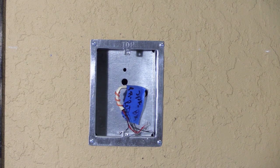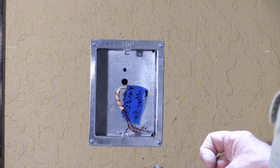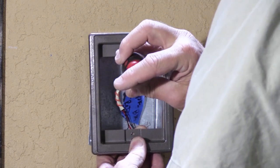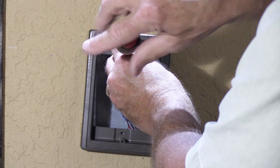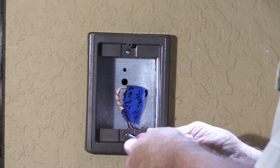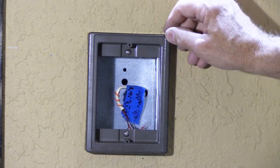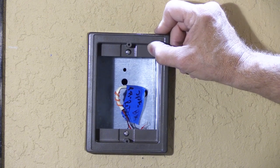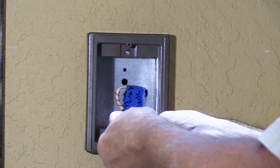Let's go ahead and put our proper one in now. We'll take our bronze update frame and put a screw into the mounting tab on the IR-6 — tighten it down most of the way but not all the way — then do the bottom one. The holes where the mounting screws go through are slotted, which allows you to slide it side to side so you can level it and make sure it's straight before tightening it all the way down.